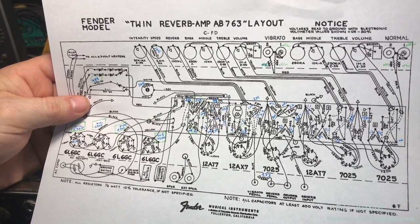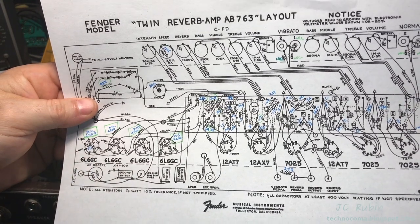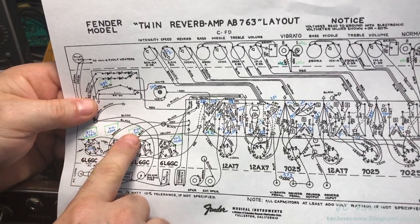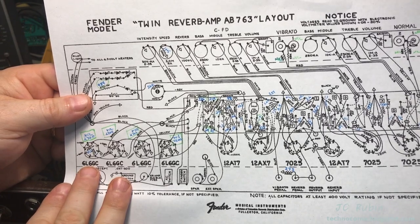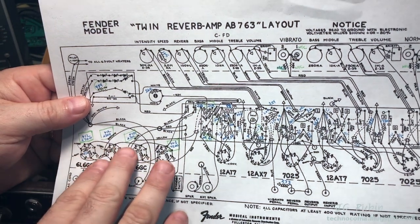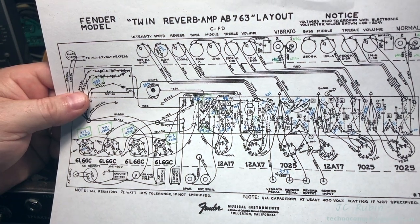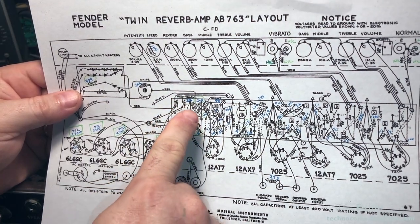And just to give an idea, we've got the 470s that are tied to the 6L6s. I've got these all 470s reading like 512, 512, 510. But I'm seeing here the other resistor is the 1500, and I'm seeing 2700 on here. Three of them measuring 2700. This one's out here at 4200, just straight out of nowhere. That's unbelievable. And I'm seeing a lot of resistors out here, and I've circled them in yellow.